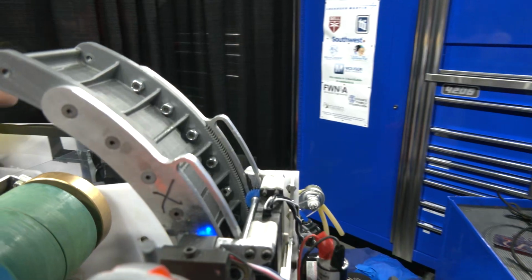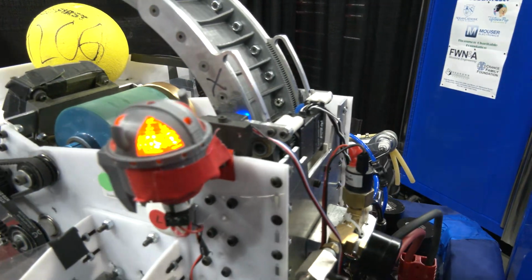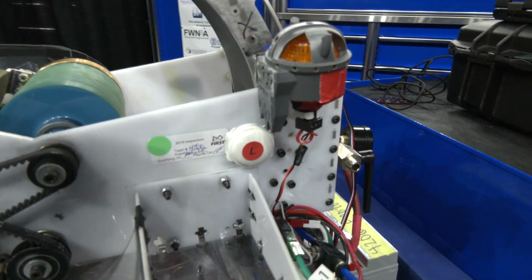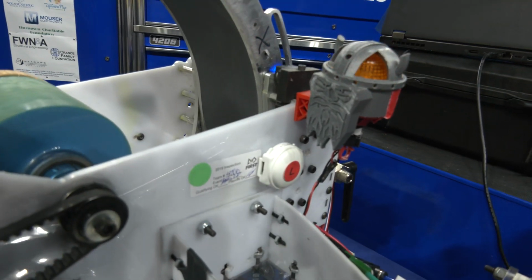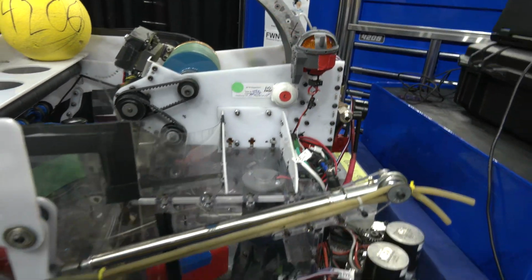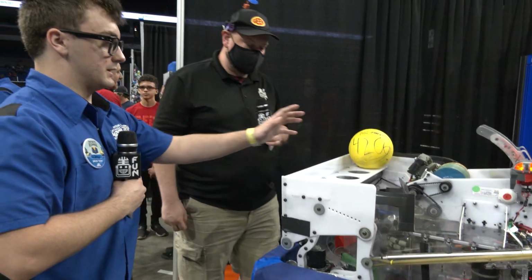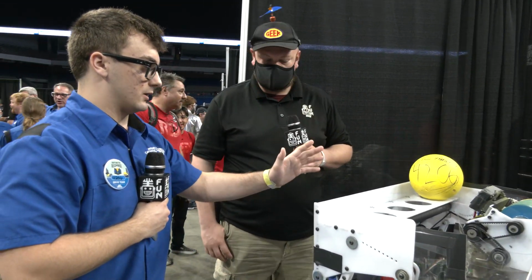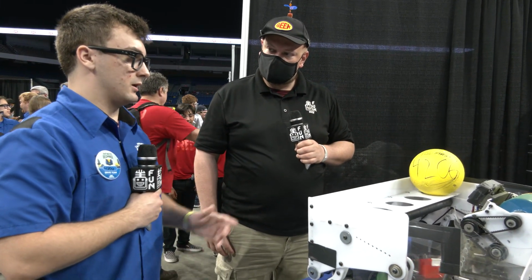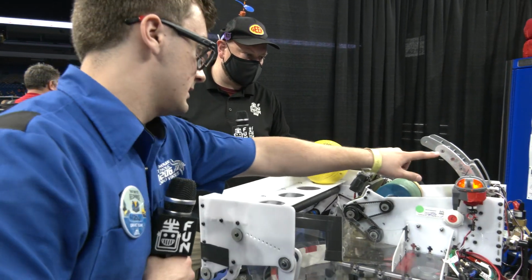So yeah, this is just a typical ABS plastic. We were going to go with a stronger, I think, carbon fiber mixed with some other material print. But we found that due to the custom CNC'd metal sides, it wouldn't be putting much pressure directly inwards on the print. So we can kind of balance it right there and then get it shooting out with the maximum pressure on the top without breaking our 3D part. And it was just a mix of finding the right position and having the right bolts in the right place for this.